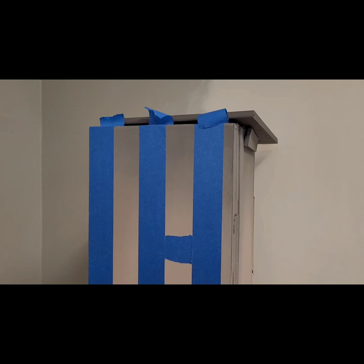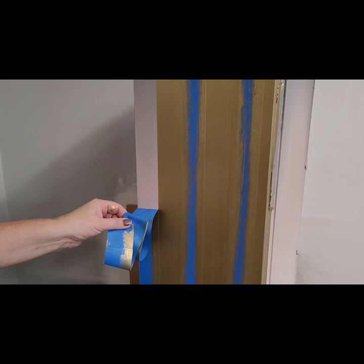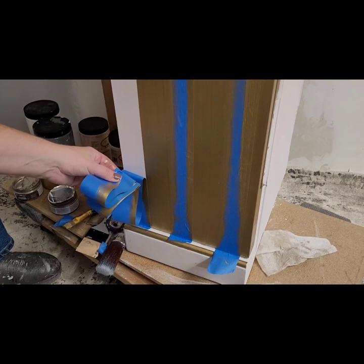Once my stripes were all taped off, I used Dixie Belle gemstone mousse in golden gem and the flat small brush to just brush in some mousse into my stripe pattern. Peeling off the tape is really where the magic happens. Look at how bold and fun these stripes are with the blended finish peeking out from behind.